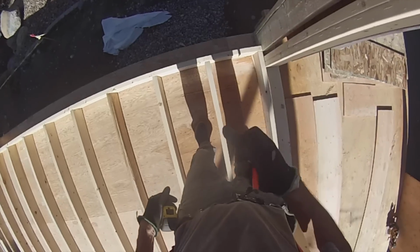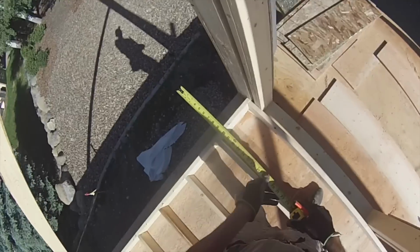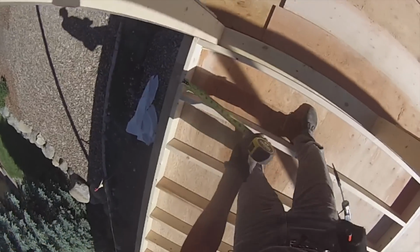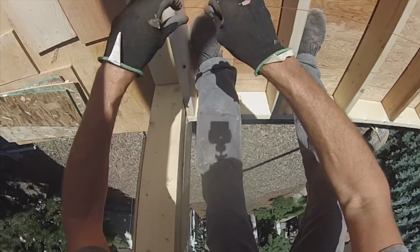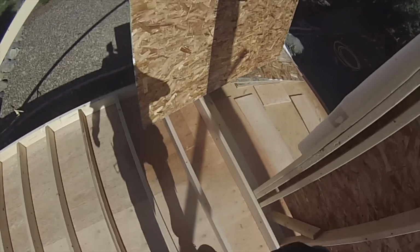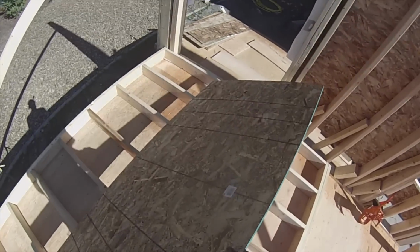I'm going to hang my sheeting over 21 inches, and that will get it to the top plates of the foundation wall. So 21 inches. 48 less 21. What is that? 27. Okay, so I'll set this first row, the bottom to my red chalk line.